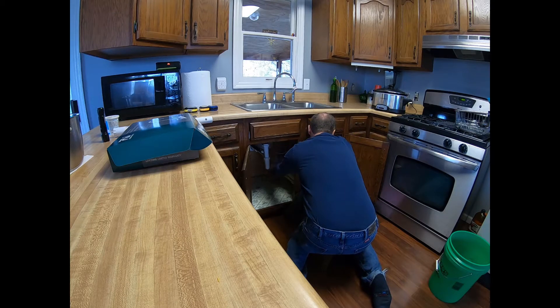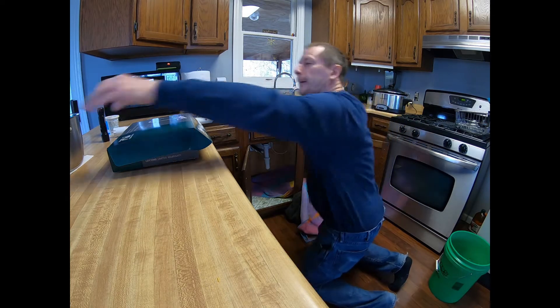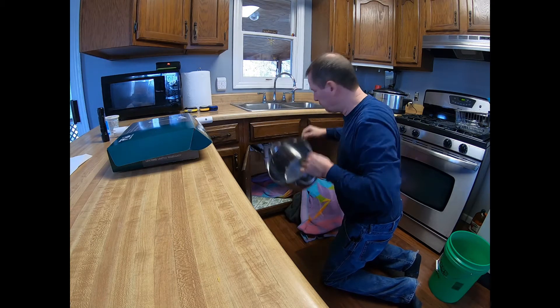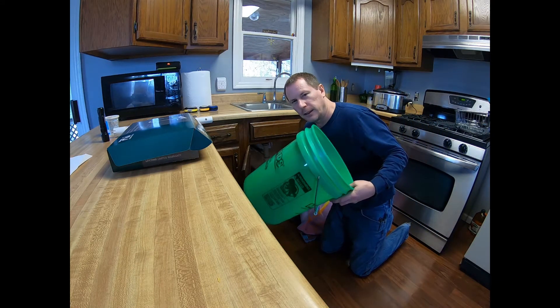This pot I was demonstrating with is also going to act as a bucket to catch water when you open the pipe. I always have a spare bucket in the back in case something really goes wrong. Before you start taking pipes apart, you should know where your main water shutoff for your house is. Mine is a well — I know how to shut it off in an emergency and drain the pressure tank. Know how to shut your main water off before you start.